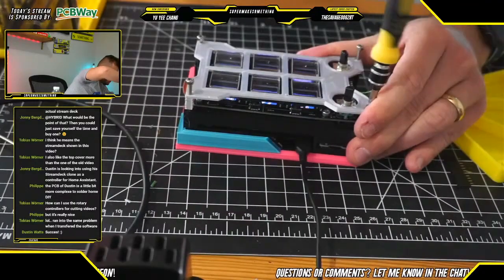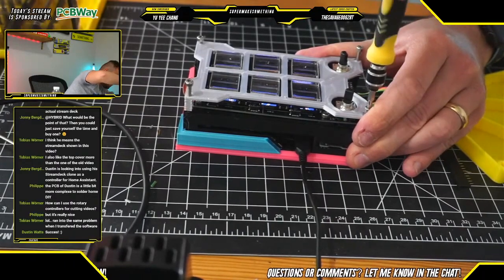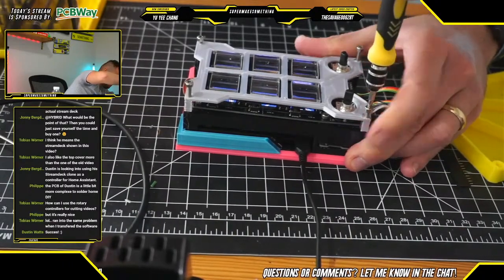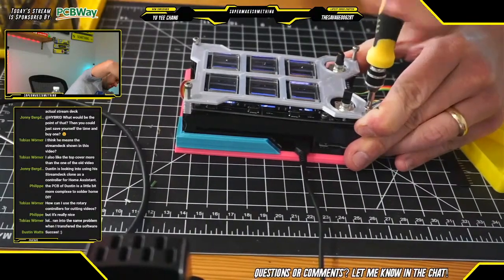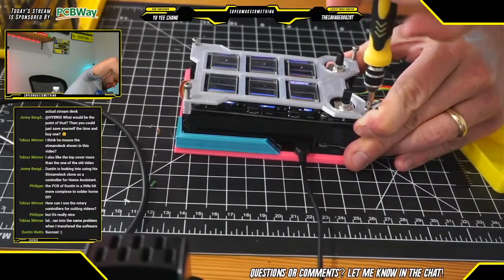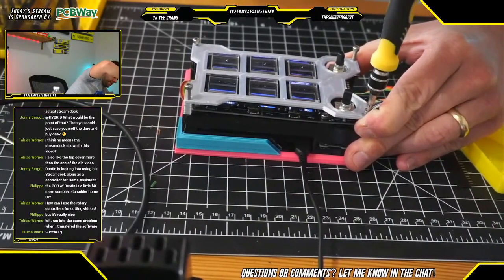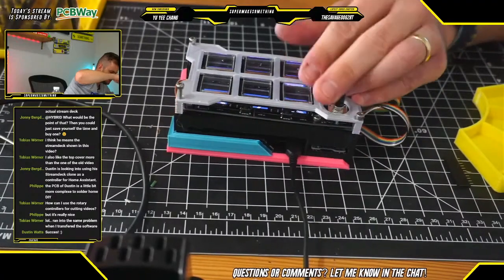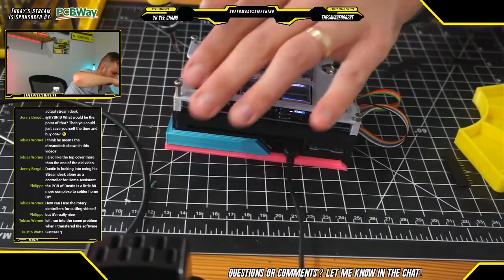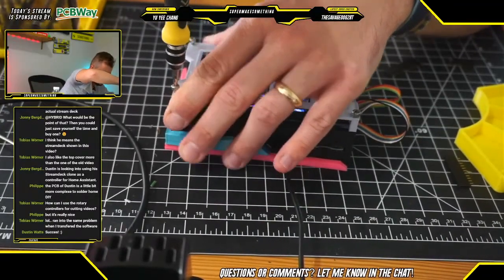Again, having made these holes a little bit too small here, this top cover is coming back to bite me a little bit, so these should be clearance holes again and not threaded. Before releasing the final CAD, I will be updating these files to make sure that the holes in the top cover are indeed clearance holes.